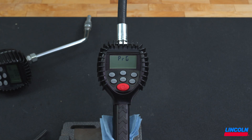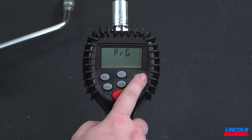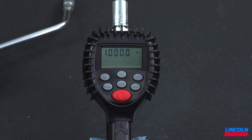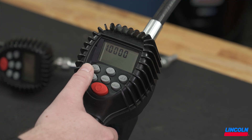Release the buttons, then enter the following button combination: 1, auto, 10, 0.1, and lastly the total button. The next screen will display the current scale factor, and the unit of measure on the right should be flashing, indicating it is selected.